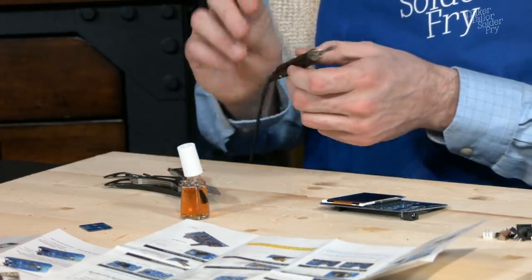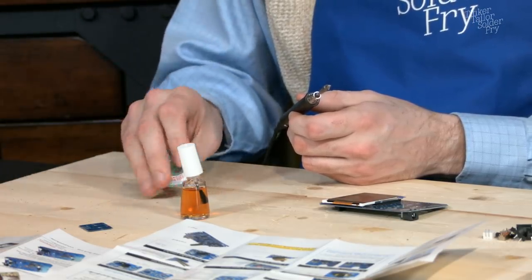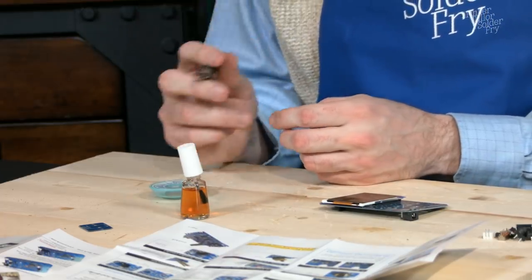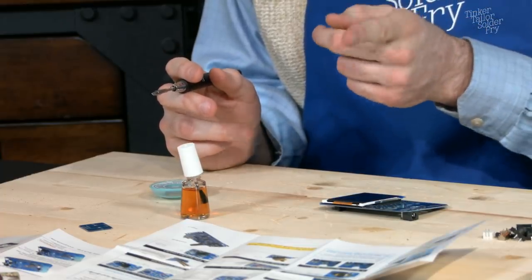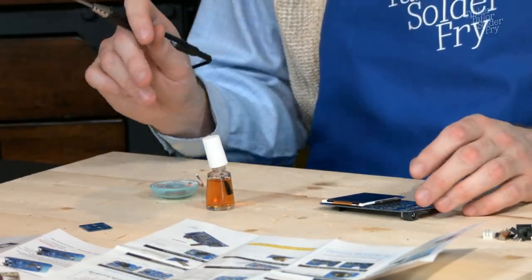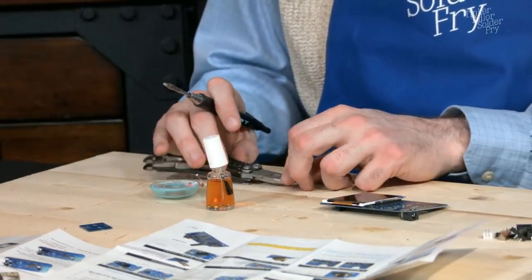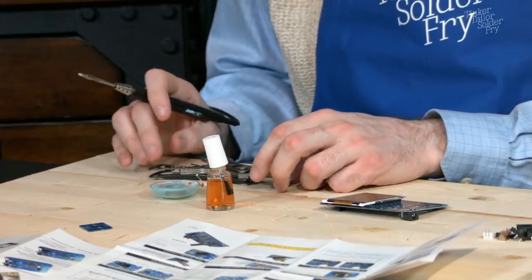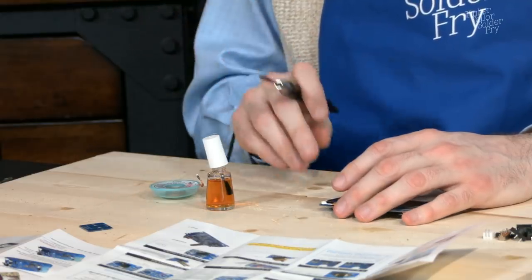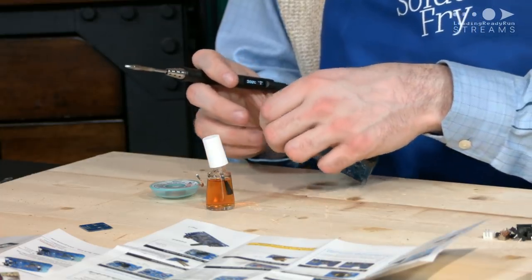Or is it like the red port on computers? Not quite enough. You are putting out some pretty heavy-duty power, but there are certain power bricks that will work. It's not USB power delivery, it's QC, the Qualcomm fast charging USB standard. That's unfortunate, because it looks like everyone's moving to power delivery. It seems so much more compact than some other soldering irons I've seen, like that whole station I used previously. You still need somewhere to put it, but you don't need the full soldering station.